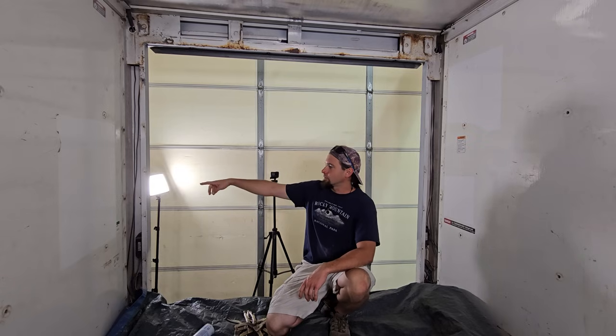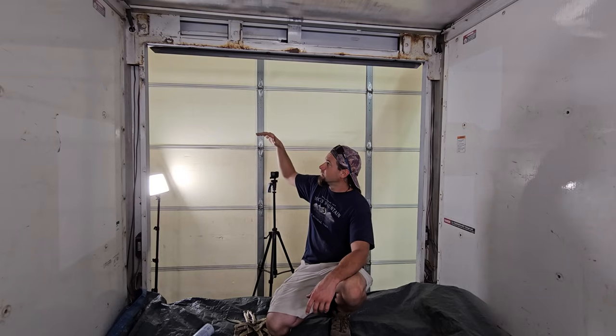Before I go any further, I need to figure out the height of my bed. The bottom angle iron for the rear wall is also going to be the rear support for the plywood for the bed. I want at least 12 and a half inches from the bottom to the bottom of the window. I'm going to put a twin mattress here. I could get an 8-inch, or they make a super soft, comfortable 12-inch one that I've been thinking about. And then a half inch for the plywood. But the window is 22 in height, and I want at least 2 feet underneath.